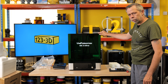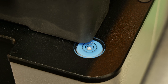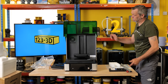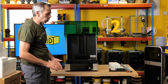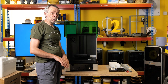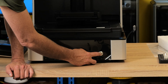We have a bit of rocking going on — let me fix that. On the front corner of the machine there is a surface bubble level for leveling the machine, so we can wind the feet. We are very nearly perfectly level, and the wobble now is in the table, not in the machine. It's not critical — you don't need to level resin printers — but it will make sure your resin sits in the vat equally so you're not at risk of it spilling over the edge.